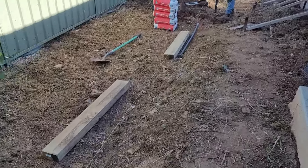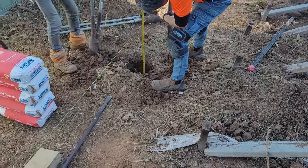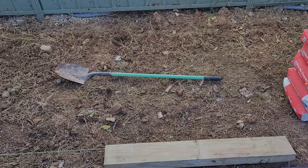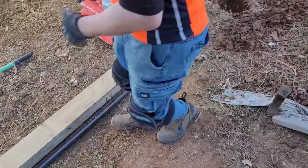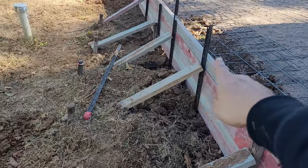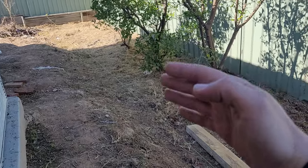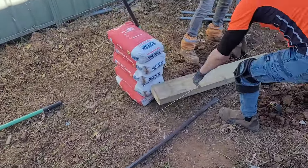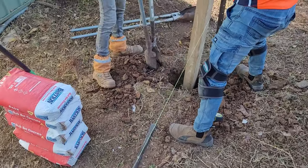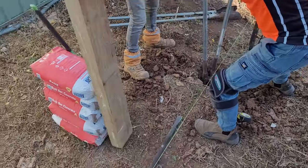Then we're going through. Then you can check it by the post. The post is here. You can check by post, and that's the access from the driveway, the access and the retaining wall on that side, and then turning and going straight to the site. First step is installing the timber retaining wall, and you need to dig a hole 600 deep and put concrete around the post.